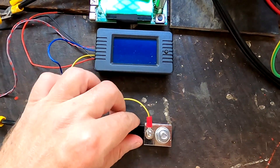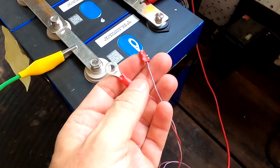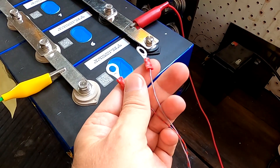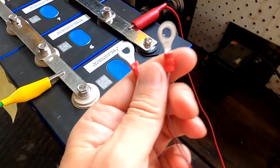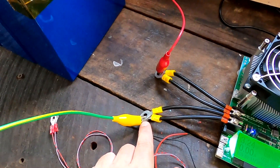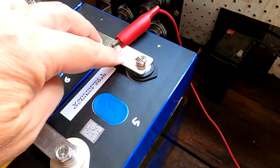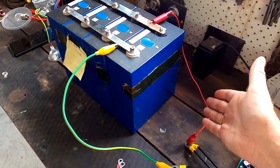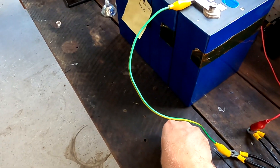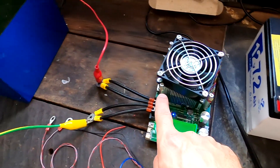Instead of a basic tester, you could use this tester because it uses two separate wires to sense the voltage of your battery directly at the terminals. It connects to the negative and positive terminal directly at the battery, so the voltage measurement is 100% accurate. Even with this tester, it does not matter how bad your connections, crimping, terminals, or cables are — it will just take longer to get your ampere-hours or watt-hours. But it only works for watt-hours if you measure directly at the battery terminals.